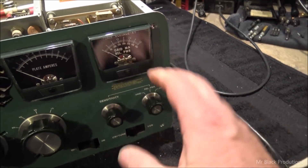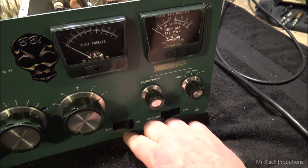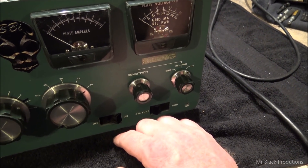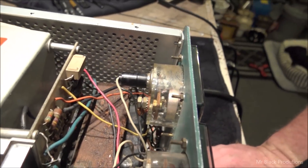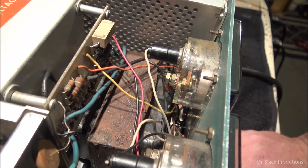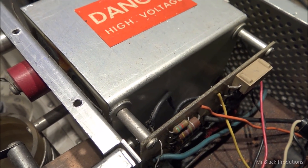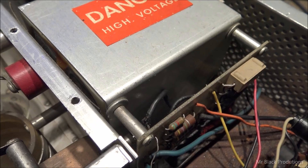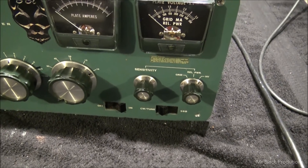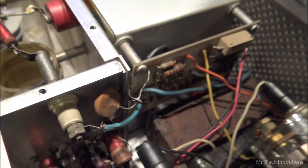Your relative power, your grid — got all that fixed and rewired up. New sensitivity knob, new on/off switch. Every single thing that came off that high volt board or down to that metering board, I had to either rebuild, reconnect, or re-hook up. Your zener was hooked up backwards for your zero signal, which controls the flop on the tubes — that was hooked up completely backwards. Pretty much every wire coming off that board was broken, so I got all that working.